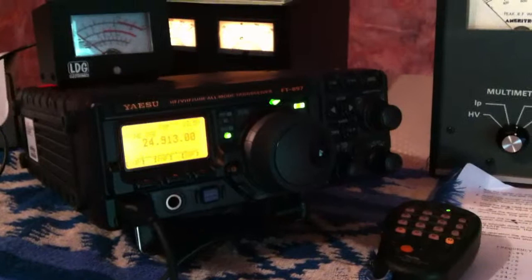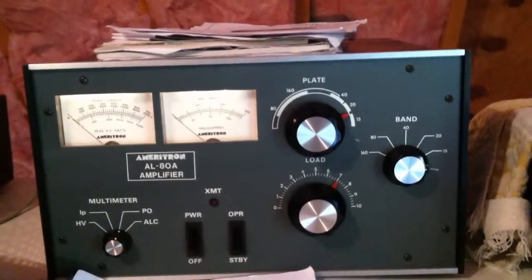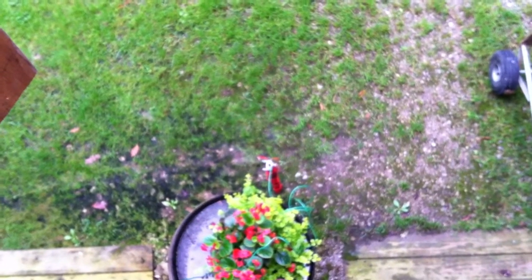So what I did was, I discussed this with KA8VIT, and being the wise ham that he is, he gave me the advice that grounding is probably in my cards. If we go outside the barn here and look straight down, you can see that thing right in front of the flowers — there is a copper ground rod, 10 feet down. The ground wire comes up and ties into all three pieces of equipment here and also to the back of the radio.